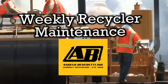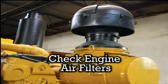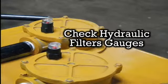Now let's talk about weekly maintenance for your asphalt recycler. Check your engine air filters. If the filter gauge is in the red, you must change the filters. Next, check the hydraulic filter gauges. This must be done with the machine running and the hydraulics engaged.